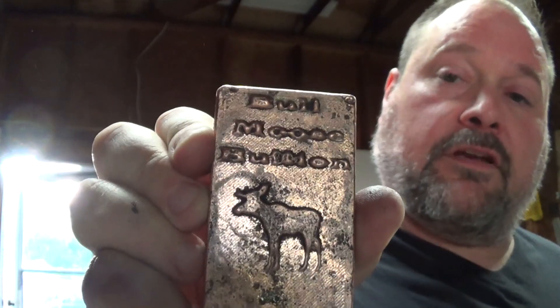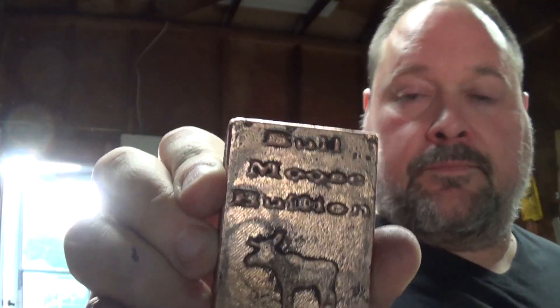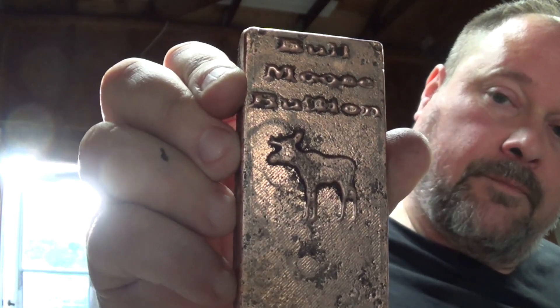That's another Monday Meltdown video for you. I am very happy with the way this came out. The lettering is legible. I just need to figure out how to make it pop out better - maybe I need to be more careful with the baby powder, the release agent, or the pouring. I know that for a second there, when I was flattening the pieces of copper pipe, I left the sand mold on the bench and it started to vibrate a lot and some little chunks were falling out.